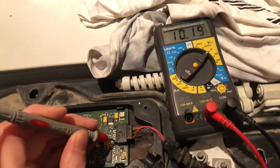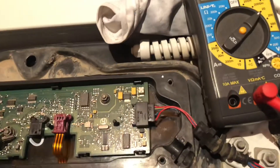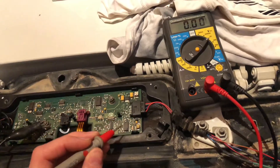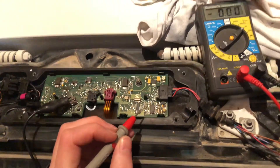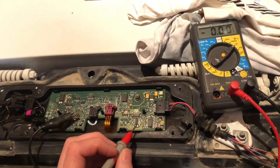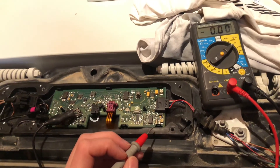So what we can conclude is that the second wire, the blue and yellow one, is reading low voltage on the faulty unit. If you follow the track of that into the board, it actually goes to one of these two chips here. I think what happened is water got into the system, shorted out and fried one of these chips, and that's why I've got a low voltage on that wire with the faulty unit.